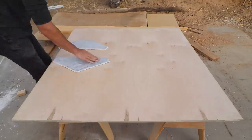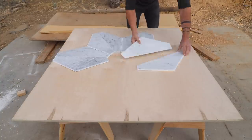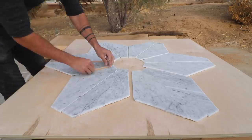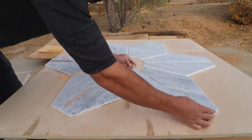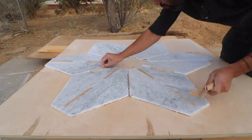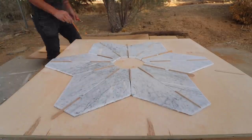The tile is going to be supported by two layers of three-quarter inch thick plywood. I laid out all the cut pieces and then used popsicle sticks to define even spacing. Popsicle sticks are great for tasks like this — they're about a 16th of an inch thick, and you can just keep adding or subtracting them until you get a nice even layout.